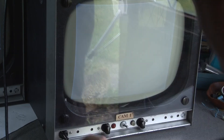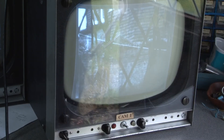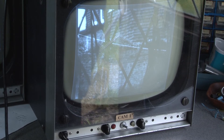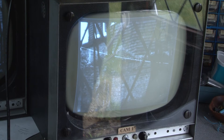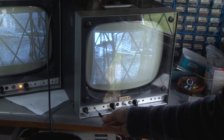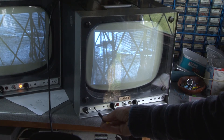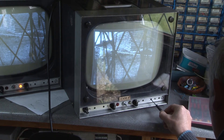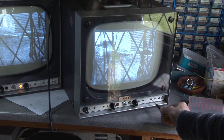We've got a raster — we've got a picture! Dirty switch. About a heart-stopping moment. Clearly we don't have the width quite right and the height seems excessive, but that might just be an adjustment. So assuming this lasts more than about five seconds, I'm actually really quite pleased. Let's see what we can do about those picture settings — we'll just turn up the width a little bit. There we go.